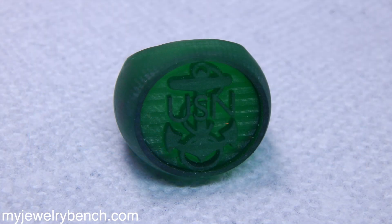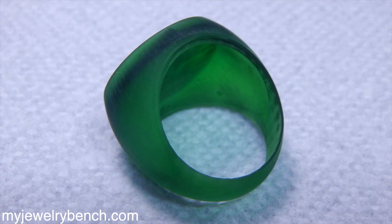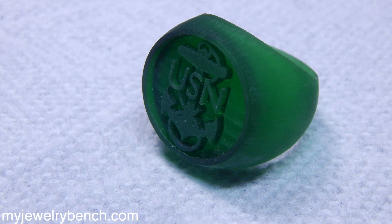To conclude: other than the fact that it's pretty brittle and you have to be careful when cutting off your supports — if you make delicate parts it will break easy — the resin prints very, very well. I think most resins from Anycubic print really good, and the settings I used here printed almost all of my models without any issues. So if you decide to do castable resin items for jewelry or anything else, I really recommend this. I'm going to keep this in my repertoire and I hope you do too. There'll be a link to get this resin in the description below and on my website.